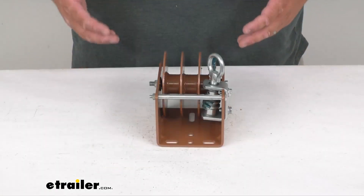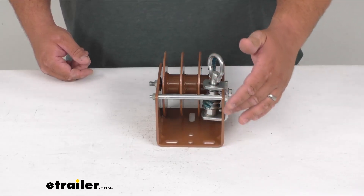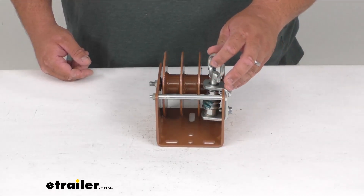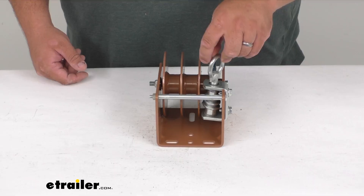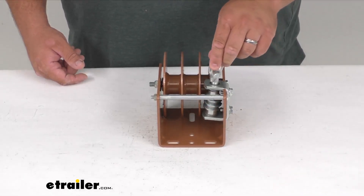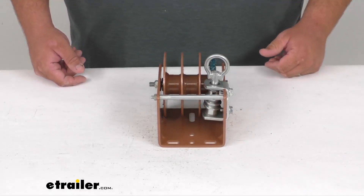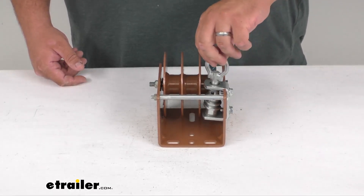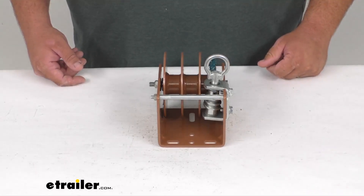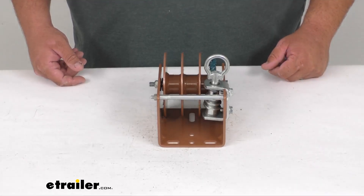This is a worm gear design winch for standard duty vertical lifting applications. The worm gear is simply a big screw in effect — it's quieter than traditional click-click-click gears, very simple design, you just keep spinning the worm gear and it keeps on cranking. The load automatically holds whenever you stop turning, so no matter if you're going forward or back, it's automatically held in position — a lot safer in some cases than ones with quick release buttons.